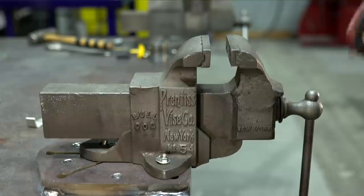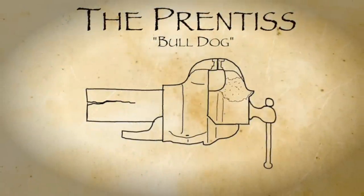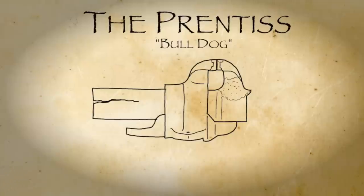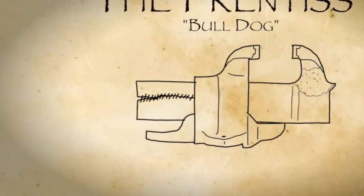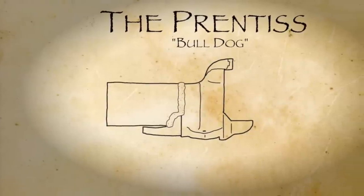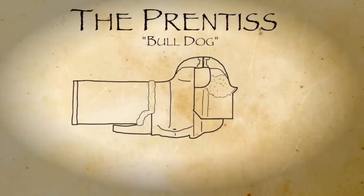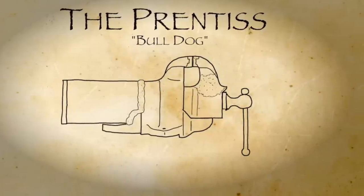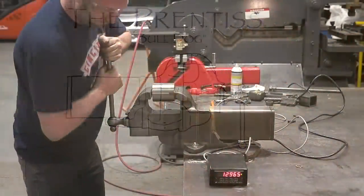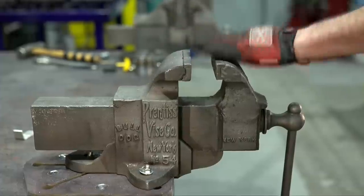I think the Vise deserves to be resurrected, so I have an idea to teach this old dog new tricks. I'm gonna start by removing all the broken bits and repair all the cracks in the castings. I'll be relocating the main nut by attaching a tail to the main vise body. I'll upgrade the screw with bearings and try to keep the original meatball and handle to keep it authentic looking as possible. After the vise has been assembled, we'll be retesting the vise for clamping force, and then hopefully we'll have turned a great vise into a super vise.